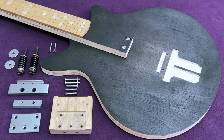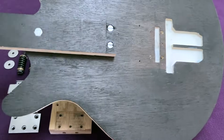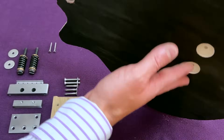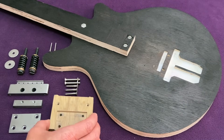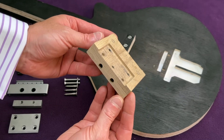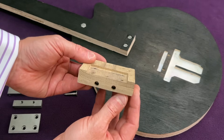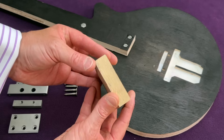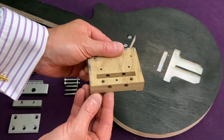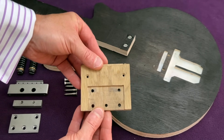This plywood sheet was previously stained black on one side, so there's no significance to that in this context. In the lower section of the guitar body, I have routed the shallow rebate in the tremolo cavity to accommodate the springs, and the rectangular rebate to locate the set screw retaining bar. I've painted these white for better contrast on camera. Turning now to the upper oak block, this has a 1/8th inch deep rebate for the knife edge bearing plate, a 3/8th inch deep rebate for the set screw retaining bar, and 2 cylindrical channels for the 1/4 inch diameter set screws. Most Red Special builds I have seen in construction have oversized square section channels routed to accommodate the set screws, but the original guitar has drilled holes like this, which minimise movement that could lead to tuning instability. I have prepared the oak block for mounting by drilling the necessary pilot holes and screw head countersinks.